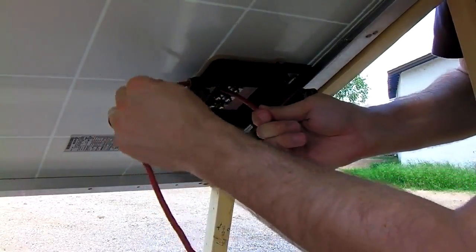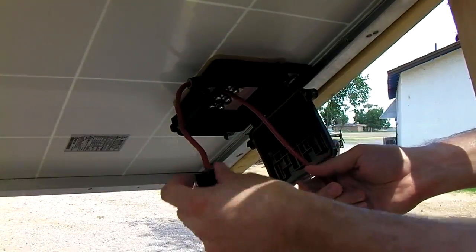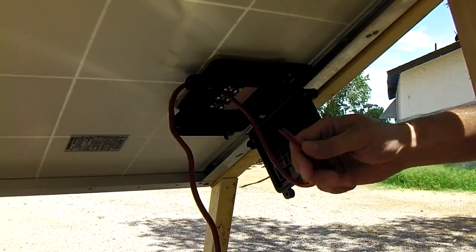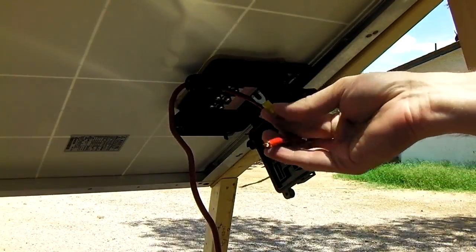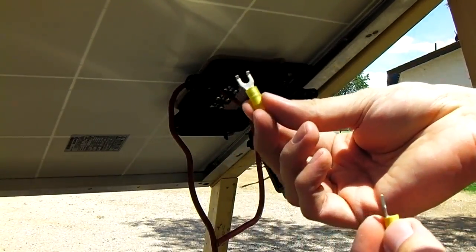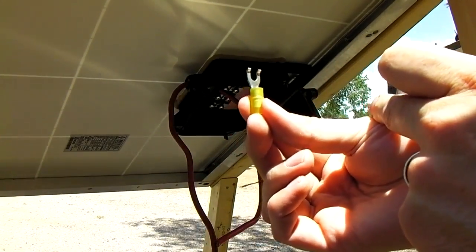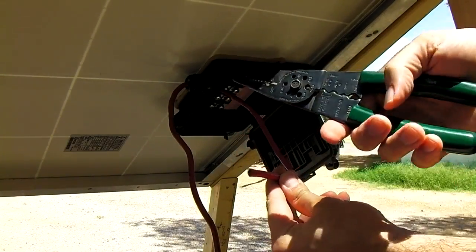Keep pushing, grab the other side and pull out about an extra foot, then slide your nut down and tighten — now you have a watertight connection to the box. Next we're going to put a connector on the end. A couple different types of spade connectors can be used. There are cheap spades from Walmart — see how they're just straight — then there are marine-grade spades where the forks have a little bend in the end so when you tighten the screw it holds on better. These are the better ones to use.